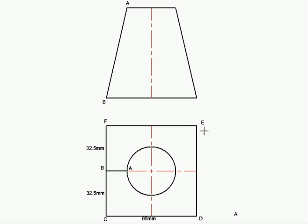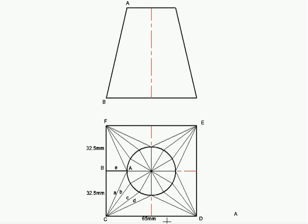Because we are working with a circle, we have to divide the circle into 12 equal parts. So that is step one, dividing the circle into 12. We then draw seams or folding lines. These lines that we've drawn here, the A, the B, the C, the D lines, right around, are lines that you're going to fold. If it was sheet metal or paper, you would have folded the metal or the paper on those lines slightly to form a piece that would go from a flat side to a round side.